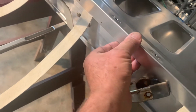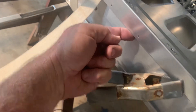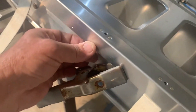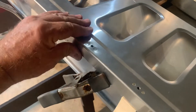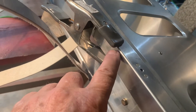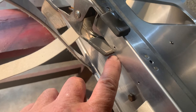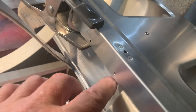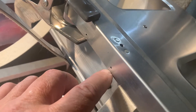The key with these is that before we drill these holes, we can use the fixture to make really sure that the bottom is flush with the bottom of the channel, like right here — it's flush with it. I've got this pulling up tight against here. You've got these tank straps in here, so make sure they're pressed down all the way because they're going to bulge out a little. But you want to make sure your flaps pull all the way up and that this is nice and flat and flush. Before I drill them, I put the clamp on the top of this, and this clamp is going underneath the spar right there, holding the bottom of this completely flush with the bottom of that spar. If you do that, these pre-drilled holes have always been perfect to drill right in and you know you're going to miss the bulb of the spar down here at the bottom.